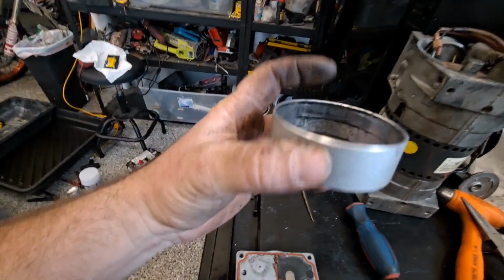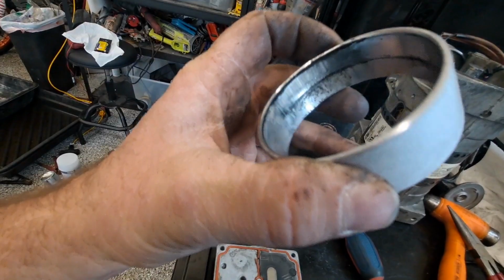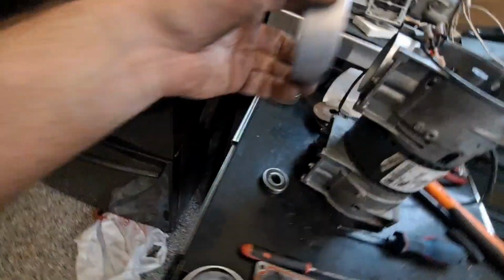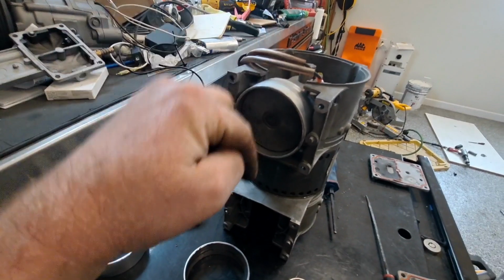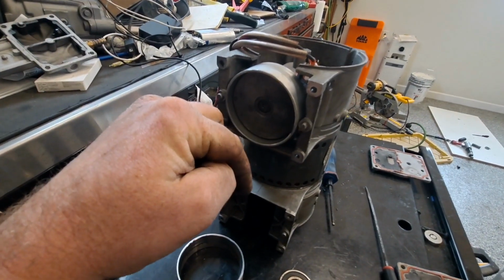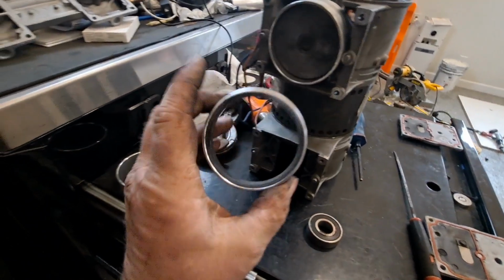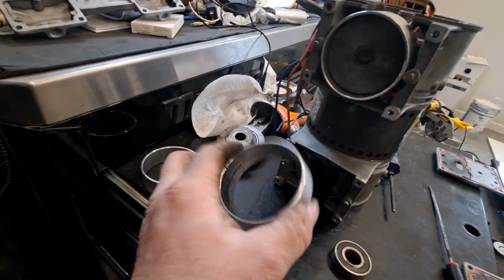And I just think if you don't have it centered, I believe, being a non-compressor expert but knowing one or two things, that's probably why this has so much wear on one side of this cylinder. If this cylinder was like this, with all the wear on the bottom, that piston was probably set too far center, so it could have been stood off a little bit from the housing. So that's a guess. I don't know who rebuilt this, and this is the one and only that I've ever done, but take it for what it is.